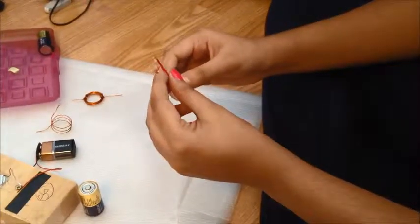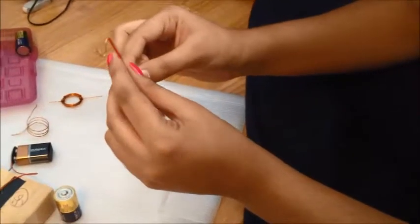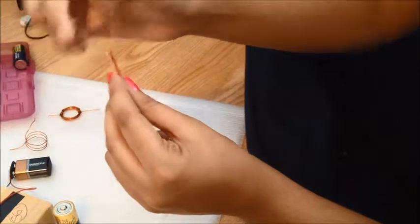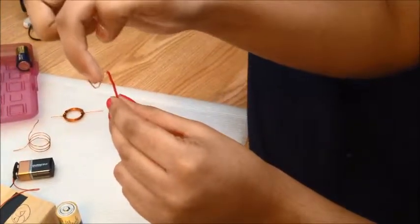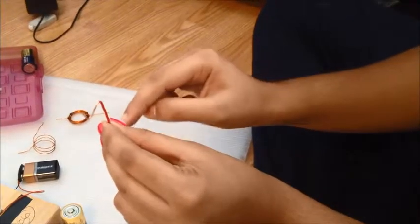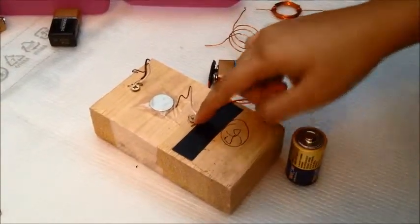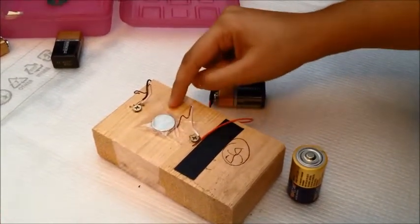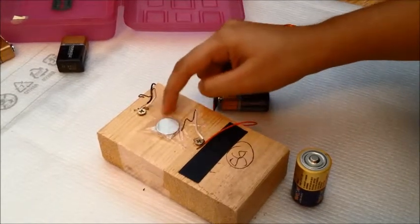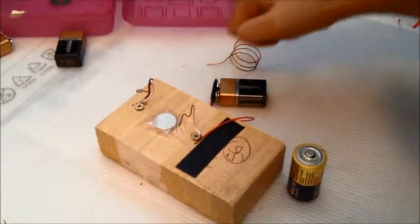For the construction of the support, take hard copper wire and bend it right here and right here — the coil will rest right here. The bottom will be used to connect the connectors by the screw to the wooden block. The permanent magnet will also be attached to the wooden block using some tape, and the polarity of the magnet does not matter.